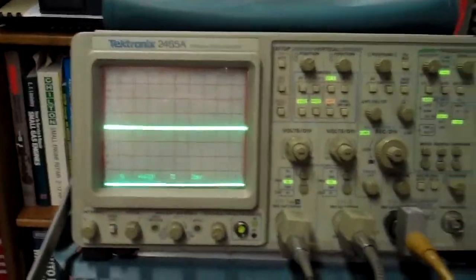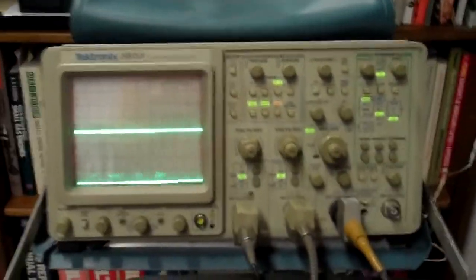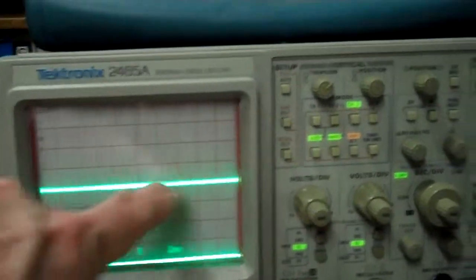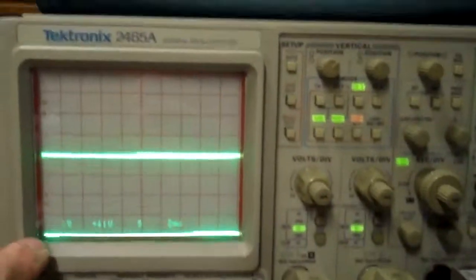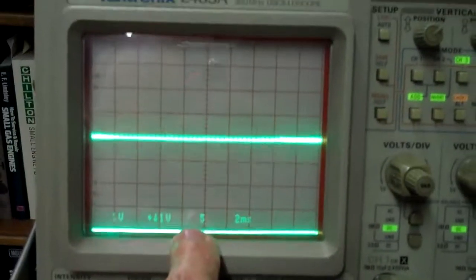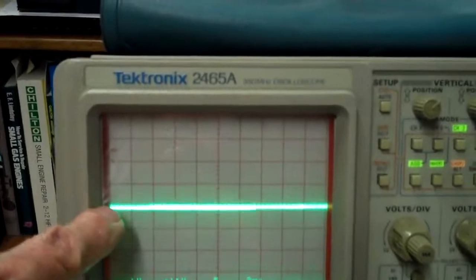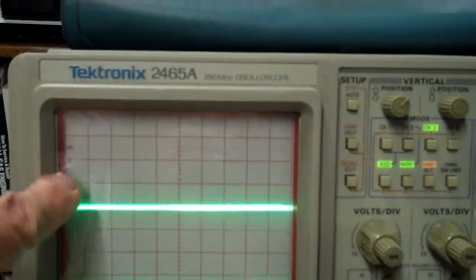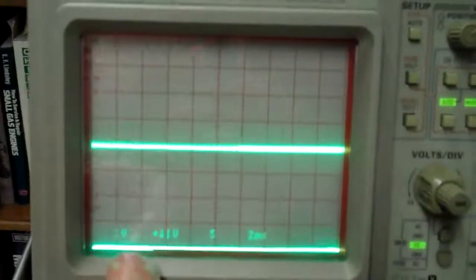So I'm going to measure the current that the loco will draw here, and I have a setup with an oscilloscope to basically show the voltages and currents. The bottom trace will be the voltage. Right now it's at 0. The middle trace will represent current. The bottom trace is calibrated at 5 volts per centimeter, so 1 gradation here is 5 volts. The current trace is set up for add and invert of these first 2 channels, so that's a subtraction function, at 1 volt per centimeter gradation.